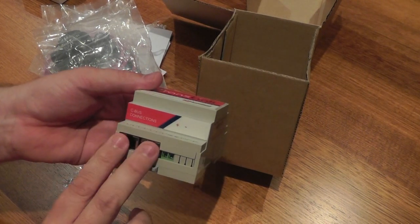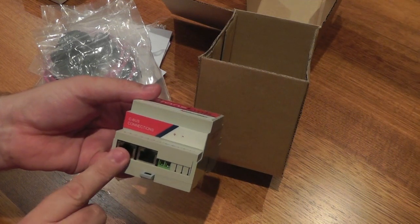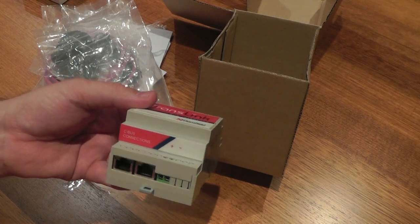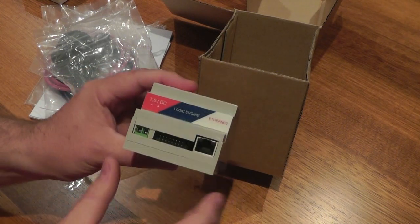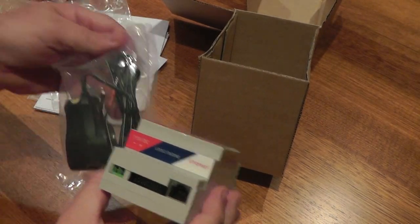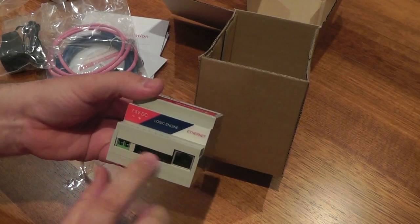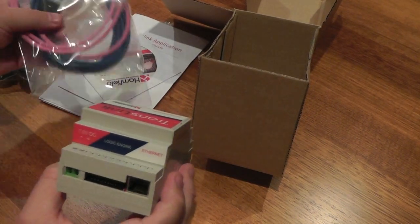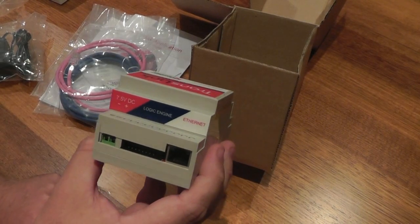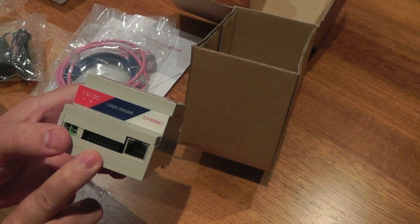The connections include two RJ45s for CBUS and some screw terminals for CBUS, so you can have three CBUS connections at once — two RJ45s and one screw terminal, or just the screw terminal, or just one of the RJ45s. On the other side there is the ethernet connection to your network, the power connection with plus and minus for the power supply where you put the red lead in the plus and the black lead in the negative. There's also a connector where the lock plug we saw earlier would go in, which locks the configuration. This connector is also used as the debug port and for upgrading the firmware.